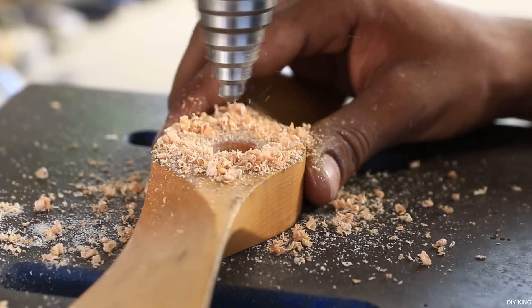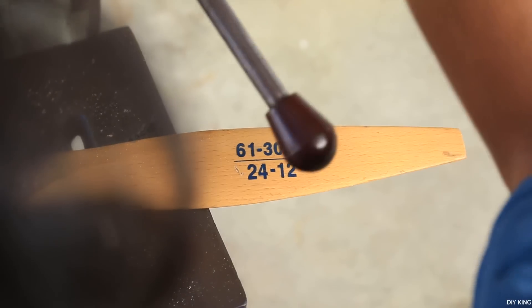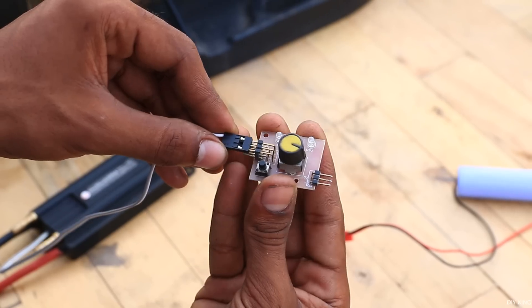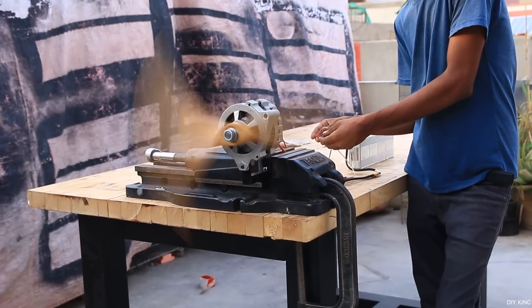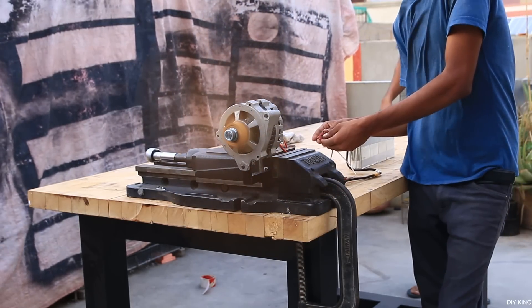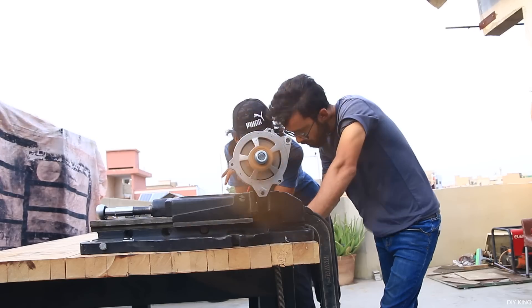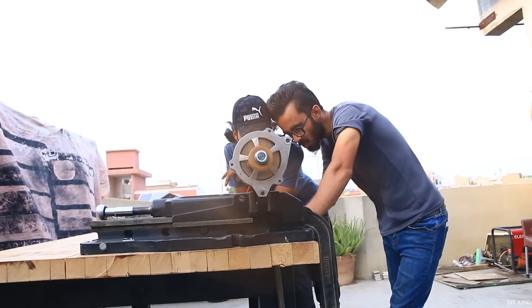Since it may not be a great generator at slow speed, it can definitely be a powerful brushless motor. The prop you see is a 24-inch prop with a 12-inch pitch — for comparison, it's usually driven by a two-stroke 60cc RC airplane engine. We spun the motor using a 10-cell lithium-ion battery pack at nearly 42 volts. We were expecting around 4400 RPM, but to our surprise we achieved only 3300 RPM. The rotor is drawing 350 watts without any load, which clearly indicates something is wrong. With the propeller mounted, it added 600 watts, drawing a total of nearly 1000 watts. The good news is that the alternator achieved almost the same speed with the prop as it did without any load.